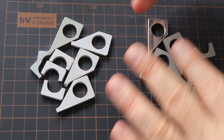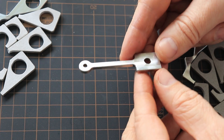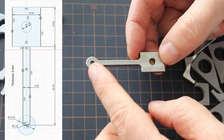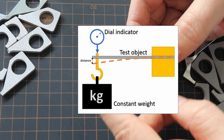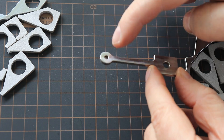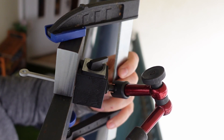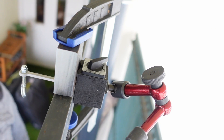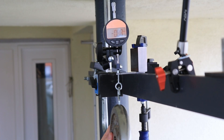Now I want to measure some kind of deformation — the bending — without breaking. I have these test objects; they will be held on this part here, and you can see the dimensions for the moment. On the other side I will place some load, trying to use the same load across all four materials — maybe with aluminum I'll have to use a smaller one. With a dial indicator I want to measure the deformation. This magnet is only a support from the back side — a limiter for this test object and for the holder from the top. I am locking this position by inserting an M4 bolt, setting up the dial indicator, and placing a 2.5 kg load to measure the deformation.